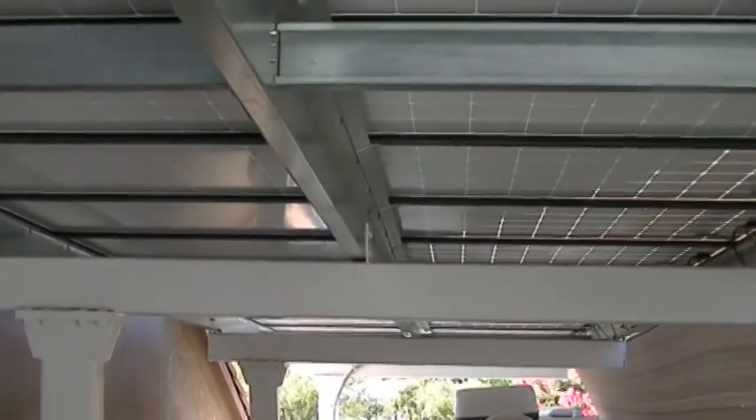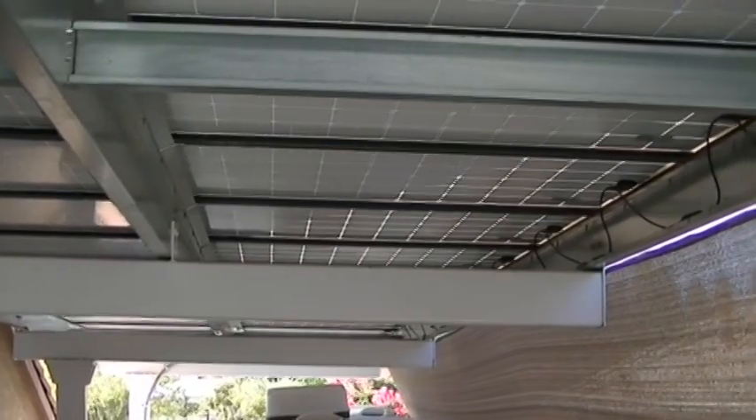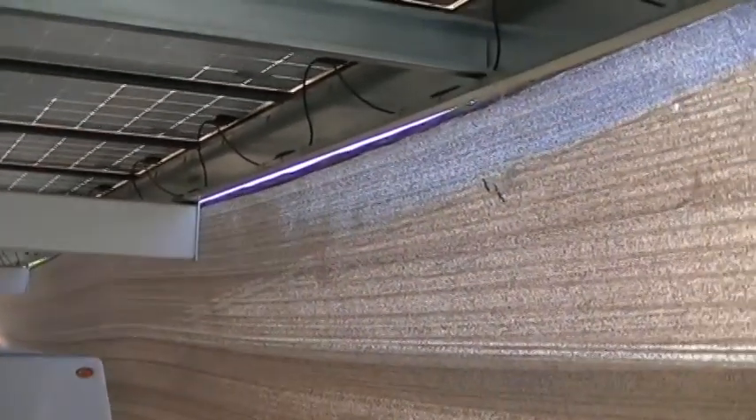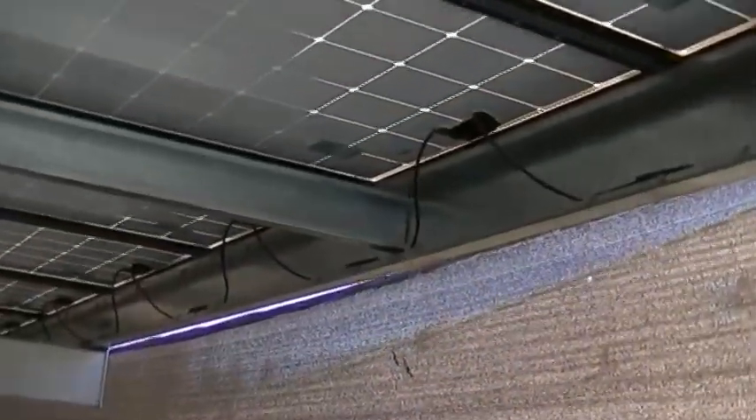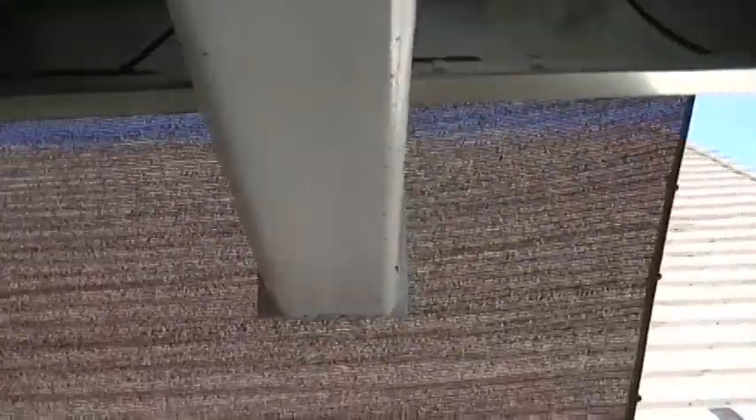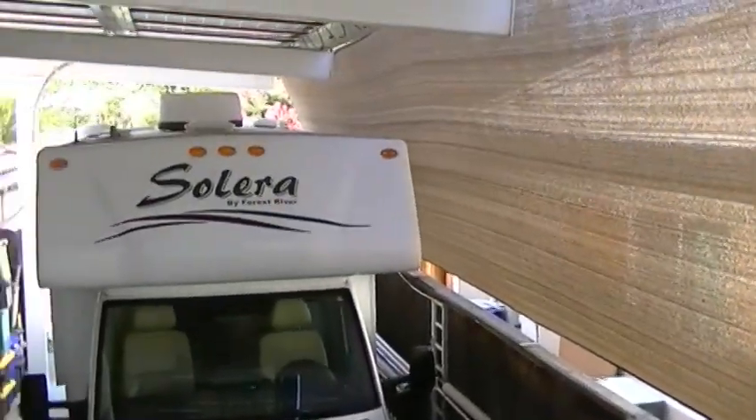Let me show you some other details. I put the solar shade — matted it to the fence down there. Aviation cable is stretched across: I build a frame for the aviation cable, then go down to some brackets with cable stretched at the bottom, and a bunch of zip ties — hundreds of zip ties.